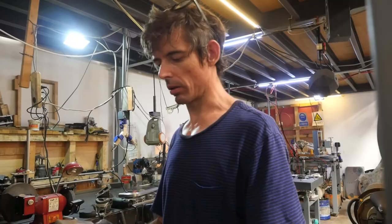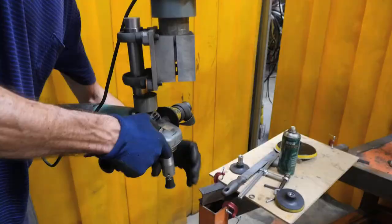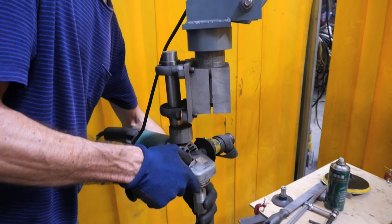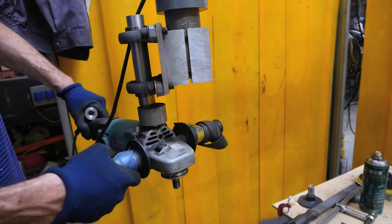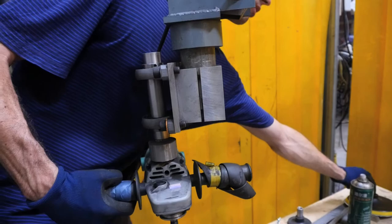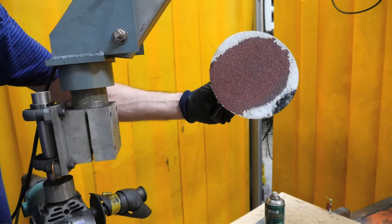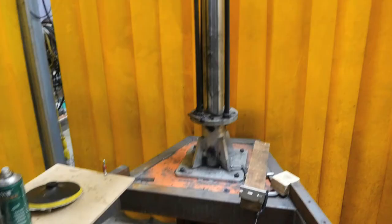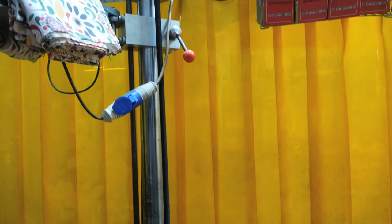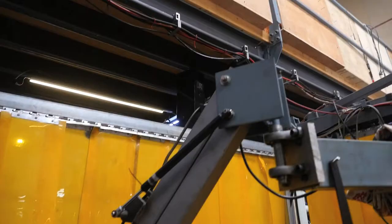This is like a bigger version of a grinding arm. I use it to grind things flat, like grind welding off. You have this kind of nasty angle grinder, but because it's on this arm it always holds it exactly straight. You can put a little thing on it or a great big thing on it — it rips through metal like anything. Gets it perfectly flat, and when you paint it you can't see anything. The only thing I bought was this solid steel part; I already had all these other parts lying around. It's really rigid and it solved a problem I'd been encountering for years — you can get it dead flat every time.